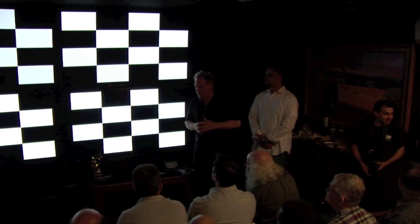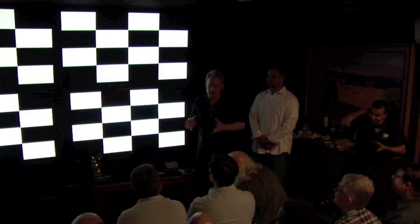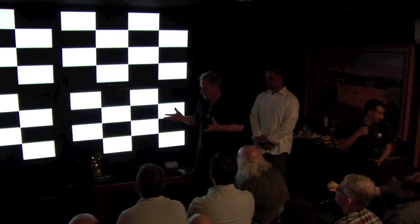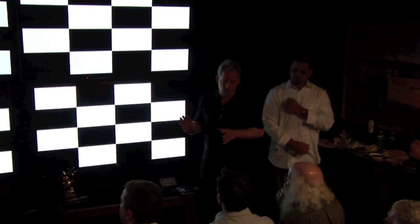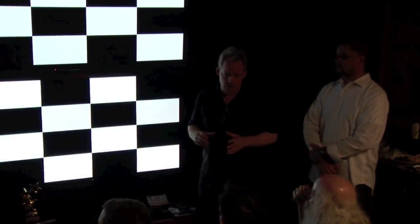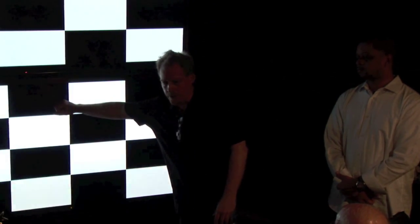But I think we'll do a little exercise on the way I like to do it when I'm analyzing a display device, whether it's a projector or a flat panel. I like to do off-screen ANSI measurements with a point-and-shoot device like my CS200. The reason for it is that that's the way you see video. Don't see video by putting your eyeball up here or over here.